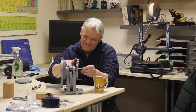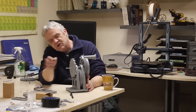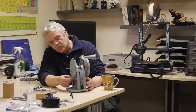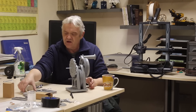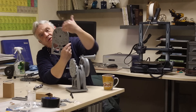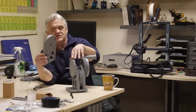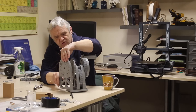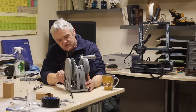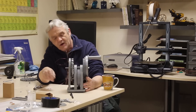We stick a washer on there because it's going to contact the bearing on the stator, then a bunch of washers so they're all level. Here's the stator — I've arranged the wires to all exit on one side, and there's the bearing that's going to press against this. We just slide that onto those two bearings and use two M6 by 30mm bolts to bolt the stator to the base plate.